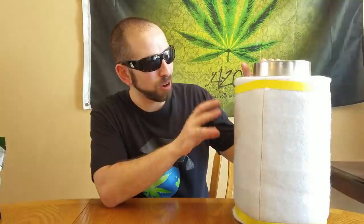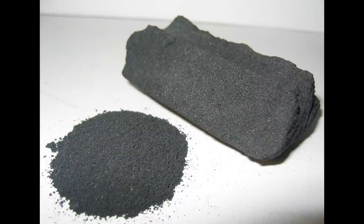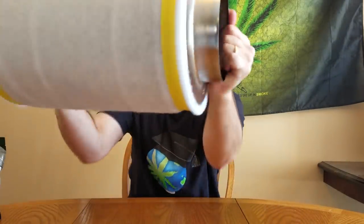What these actually are are largely hollow metal cylinders filled with activated carbon granules. Most of the time the carbon is just a crushed charcoal, like it is inside this one — you can hear it if I shake it. More expensive carbon is actually made from coconuts and it's called coco carbon. It's harder and it lasts longer than charcoal-based carbon.